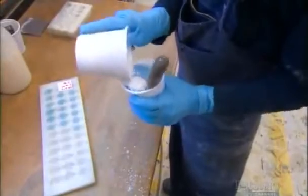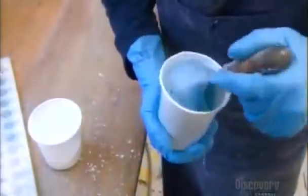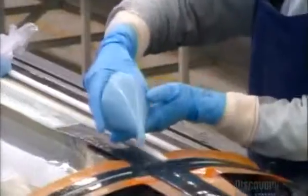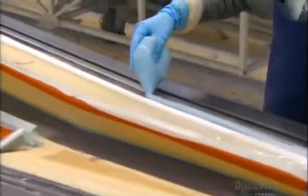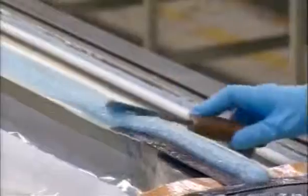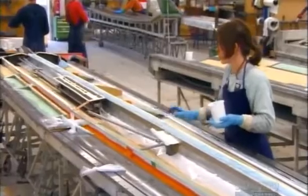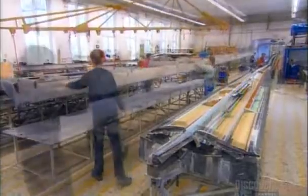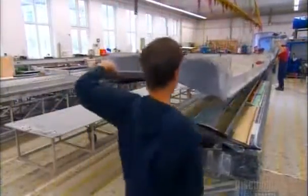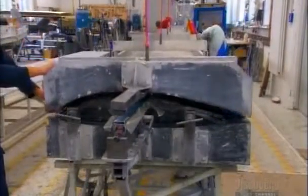The two wing parts are glued together using the same epoxy resin that bonds and seals the carbon fibers. Mixing in some cotton flakes helps thicken the resin, which they apply to the main spar, the wing's backbone, then to the front, back, and center portions. Using a crane, workers carefully fit the two wing molds together. The mold's weight forces out any excess glue.